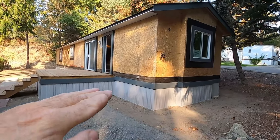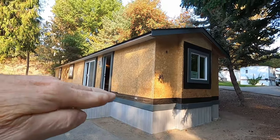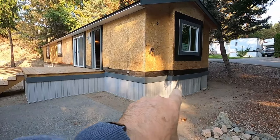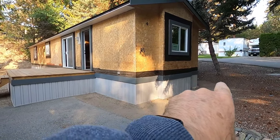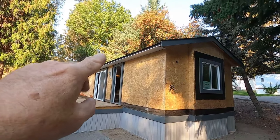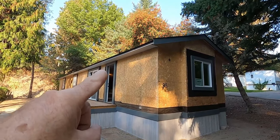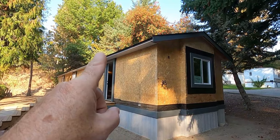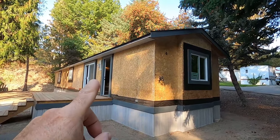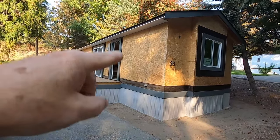The process is: I did all the bottom work for the siding to come down to. I've got a level line established with that 1x8 board above the skirting. After I did the new roof, I put the soffits in. So now the siding will go up to the metal soffit. That'll be finished — we just have to fill it in between the bottom and the top.